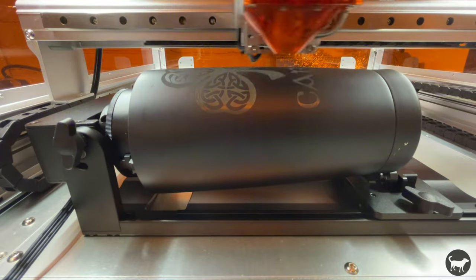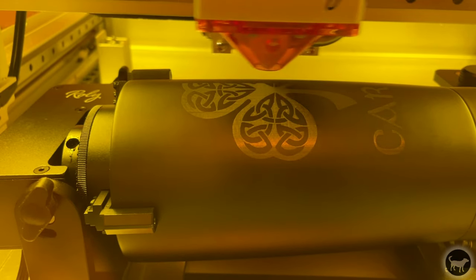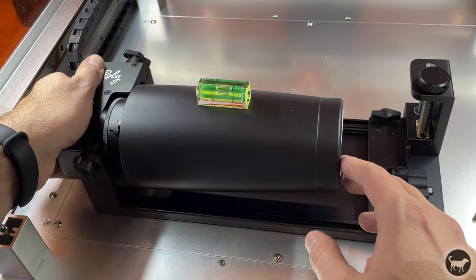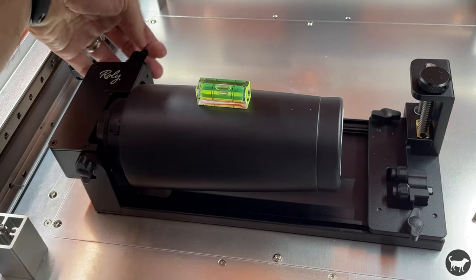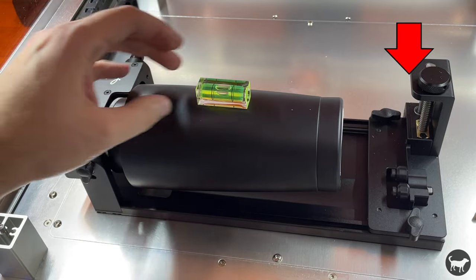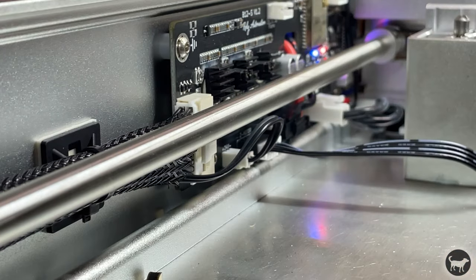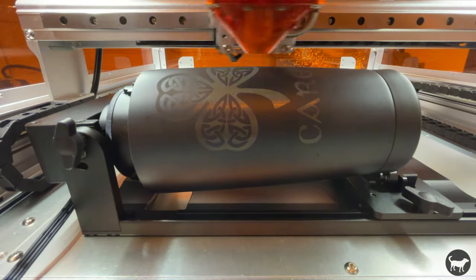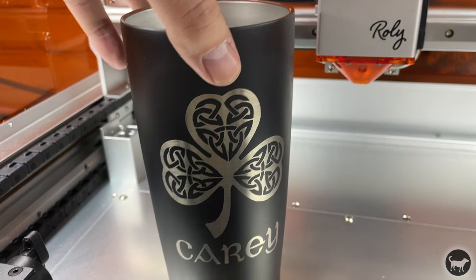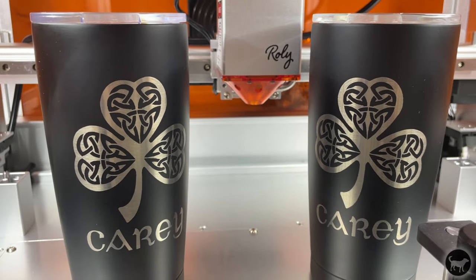Another feature that this enables is that with the pegs you will know exactly where the top of the cup is in relation to the laser coordinates, so they give you some safe positions that you can choose in the move tab to position the laser directly above the cup. This all makes sure your tumblers always come out consistent time after time. I also ended up switching the position of the chuck jaws from the inside of the cup to the outside to have an even more consistent job. All you need to do is place the tumbler in the jaws and then using the level rotate the chuck until the top of the cup is level and then tighten down the chuck pivot. After it was set up, I plugged in the rotary into the front board and ran the job at 4500 millimeters per minute at 75% power and 318 dpi using the 10-watt laser switch. It came out really nice and square. They are Christmas gifts and they turned out great.